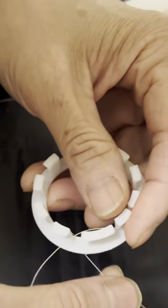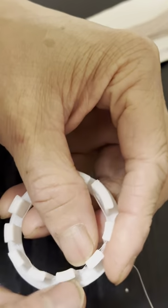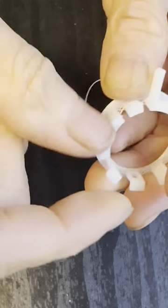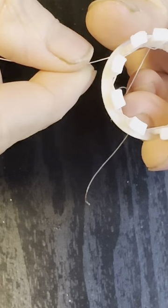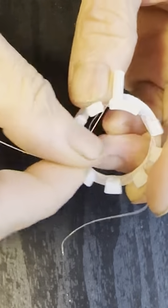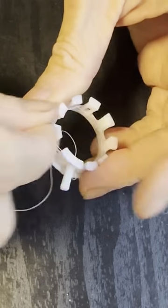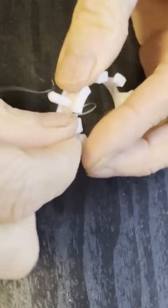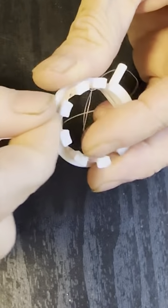However, after making this video, I find that the variometer range, if you wind it in this way as a spider or a basket coil with interlaced turns in and out, the variometer range will be smaller. Hence, later on, I remade it using just a flat coil, just wound on the outside.